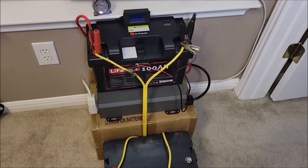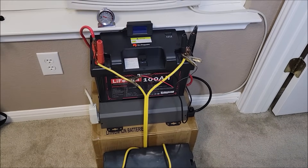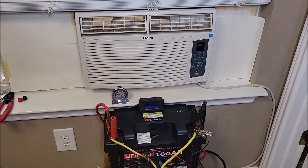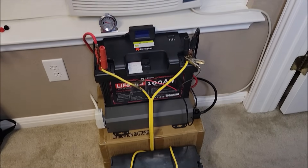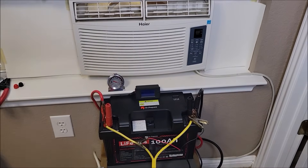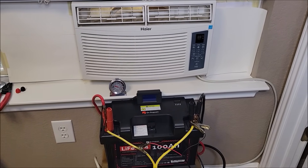To really do this test, I've got a little yellow jumper cable and I'm putting another 100 amp hour battery — which also capacity tested very well — in parallel with the first one, making it 12.8 volt, 200 amp hours. The reason I did that wasn't just for longevity, but to handle the surges when the AC kicks on and off. I'm going to run these two batteries together with that inverter down there, which is a 2000 watt pure sine wave inverter.